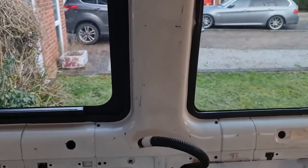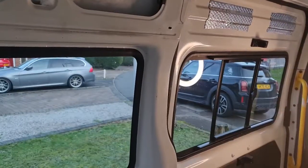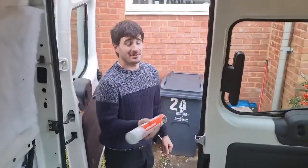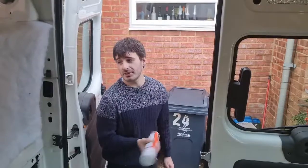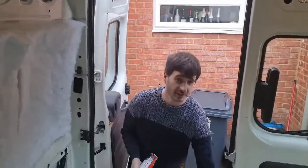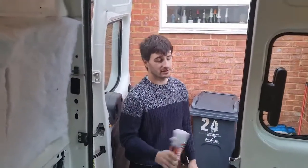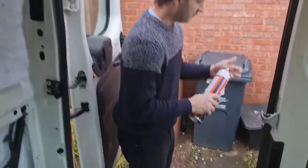Now we're going to do the expanding foam — we've got three cans. We're going to try and put them in the joist things and pillars between the windows where it's hard to get the insulation in. But first we're going to do a test, because when this expands it's an exothermic reaction — it gets very hot — and we're not sure how it's going to react to the insulation, if it melts it and goes all funny. It's better to find out on a test piece than to spray it all over the insulation we've just put in.